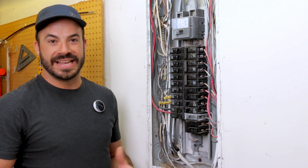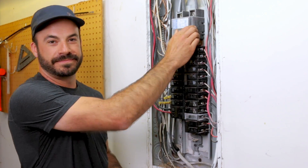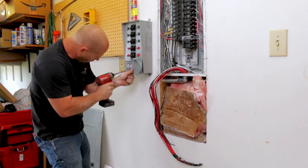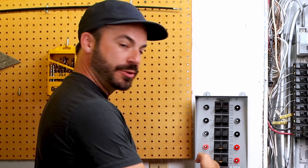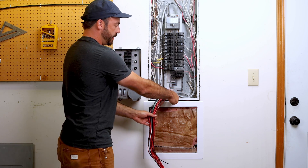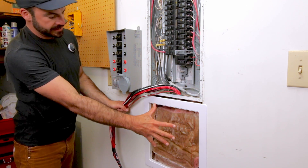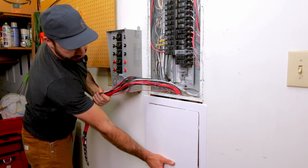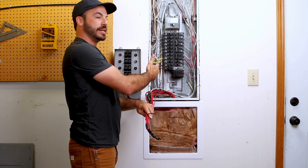If you've got backup lighting, now's a great time to plug that into your Solex F3800 and start enjoying its backup power. Our electrician has been busy — the transfer switch is now installed at the predetermined location. We've routed the big bundle of wires out the back of the transfer switch, through the wall, through an opening in the stud, and up through the bottom of the breaker panel. An access opening was cut to run the wires and will be closed with the snap-in panel when finished.